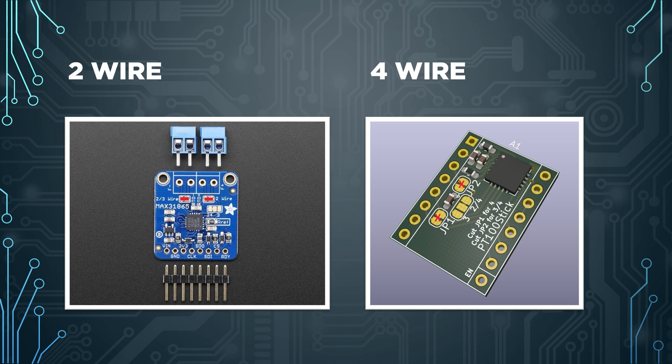For wiring two-wire sensors with Adafruit or CJ MCU boards, you bridge the solder pad jumps — same for both. You don't need to do anything for four-wire on those options. For the PT100 stick, you don't need to do anything for two-wire, but for four-wire sensors you need to cut the traces marked with an X. For three-wire on Adafruit, cut the trace marked with an X and bridge the pads marked with a rectangle. On CJ MCU you remove a zero-ohm resistor jumper instead. For three-wire on the PT100 stick, cut the traces marked with an X and bridge the pads marked with a line.